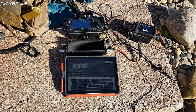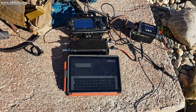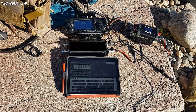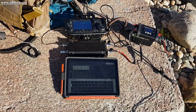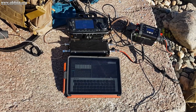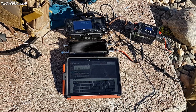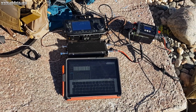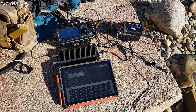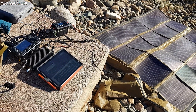The first part of the session was basically downloading messages from Oscar Hotel 6 India Juliet. I went ahead and replied to a few of those messages and now I'm going to send them off, but this time through Lima Alpha 3 Foxtrot. For both sessions I used 60 meters, and there's a very specific reason for that. WARC bands — 60, 30, 17 meters and so on — never have any contest traffic. WARC bands are the places QRP operators hide when there are contests going on in the primary bands. Keep this in mind.